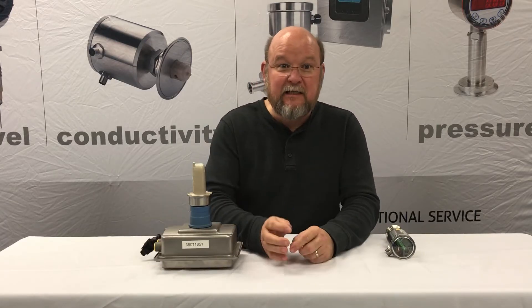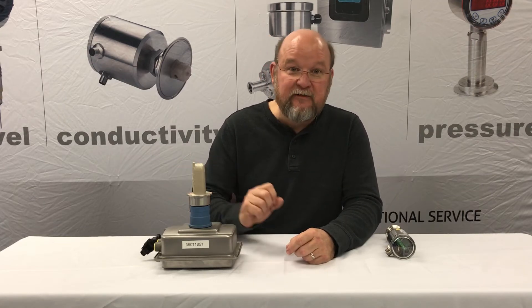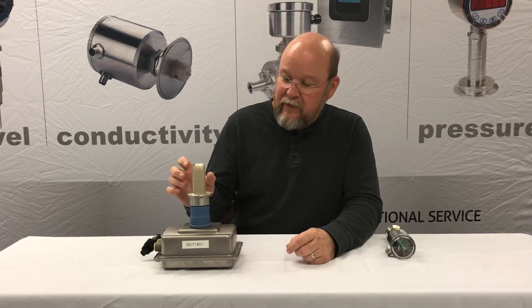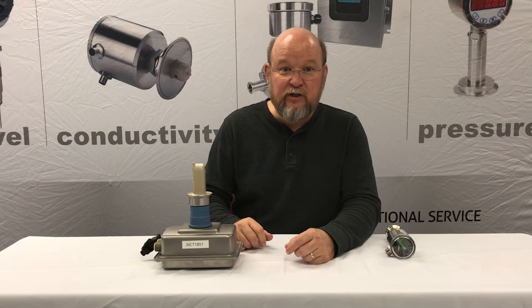Well, that doesn't have to be part of daily business. This reoccurring failure is an effect of the design of some conductivity sensors where they use an overmolded plastic — meaning this plastic is molded over a stainless steel substrate — which causes it to stress over time and fracture.